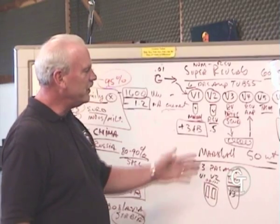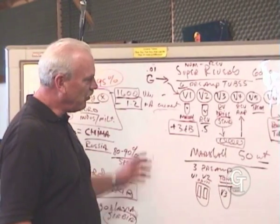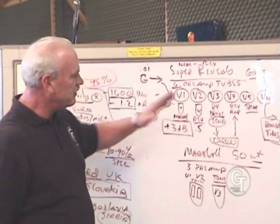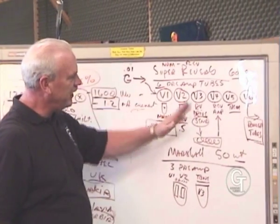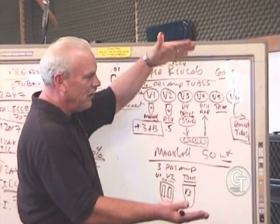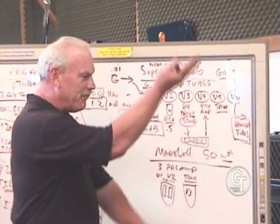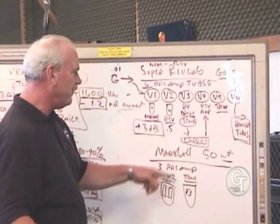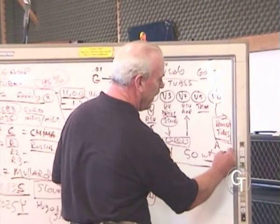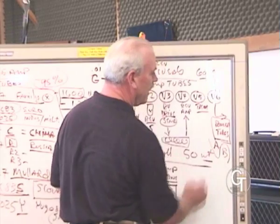We can get into what this is also called, a matched phase inverter. You might recall earlier the sine wave, the A and the B. That tube is what splits what has been essentially a Class A signal, each tube handling the signal, handing it off from one to the other, splitting it for divide and conquer to the Class AB output section. Super Reverb, Marshall 50, both Class AB amplifiers. So this creates the A and the B side of the sine wave.